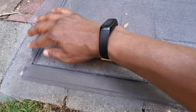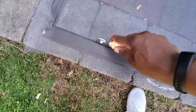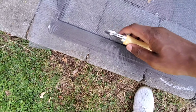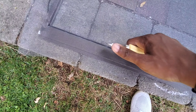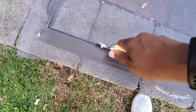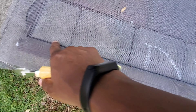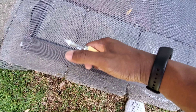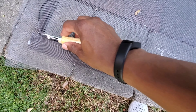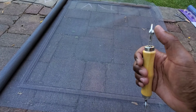When you cut the mesh at the edges it just tears easily and runs right up the edge. So you want to always push in — make sure you have the right side, because the convex won't do much but the concave will push the spline in. Just push in and roll gently. Don't go like a pizza roller — you will just cut it, unless you have a plastic anti-cut spline tool. Just take your time with this.